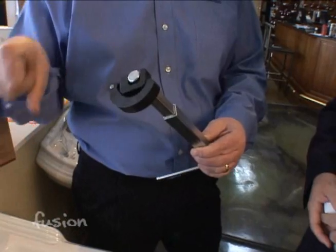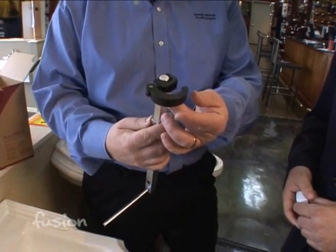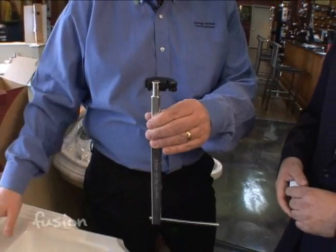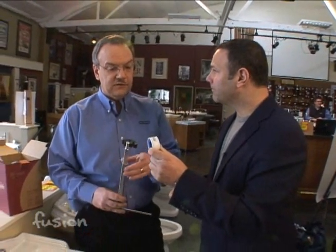You can't do it with a conventional wrench because you don't have enough room usually, but this one allows you to actually grab hold of the nuts that are underneath there and turn this in very little space. So that will disconnect the faucet from the sink. All right, I'm going to need a bucket and some Teflon tape. Yeah, a little Teflon tape later on, okay.